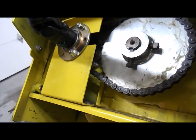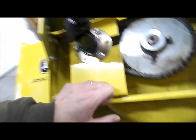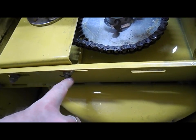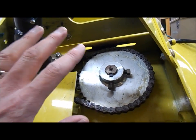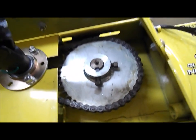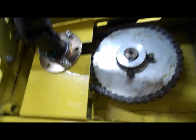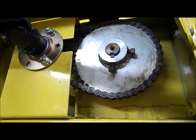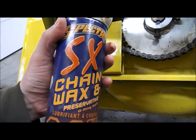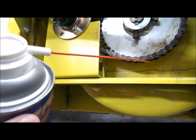Being a new chain, it's gonna wear in some. The biggest thing when you move the plate is to make sure you've got the same spacing from the slot to the nut on both top and bottom, because if you don't, that pulley will sit at an angle and you'll end up with some odd wear. Also, you're supposed to lubricate the chain every 25 hours — I'm right at that 25. I used chain wax, same stuff I use on my motorcycle. I just spun the chain around and lubed it up.